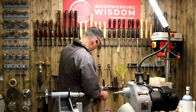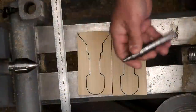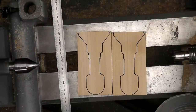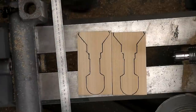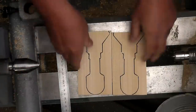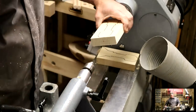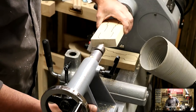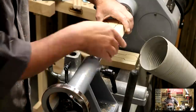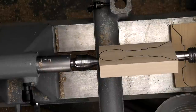He's going to come out for a little pro drive. So the 16 mil pro drive is going to go in now. There we are, so that's that one. Tailstock center, I'm going to go with a ring center. Okay, and let's pop the pro drive on the bigger end. Make sure you get them in the right place. It's quite important here that the center is actually the center of your marked area. Otherwise, you won't follow that black line because it'll be off too much. So let's see if the camera picks that up in a minute.